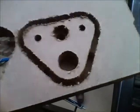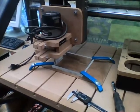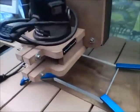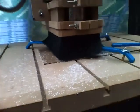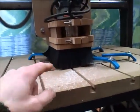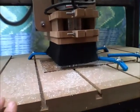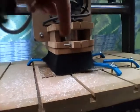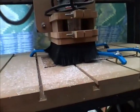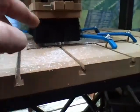So that was my test run in MDF and we're going to try to repeat it in Lexan. I have to say that this is pretty cool doing the polycarbonate. I'm using a really slow feed rate — about 10 inches a minute and a plunge rate of four inches a minute.